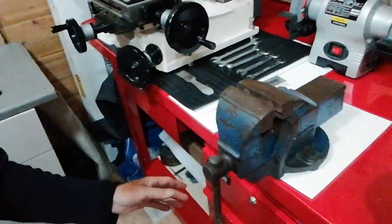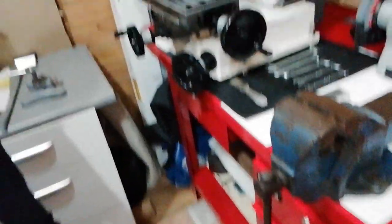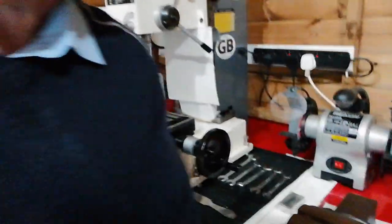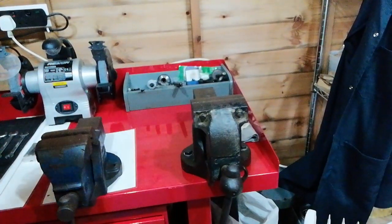Then we have to drill the holes. The best way to do this is to drill one hole first and then put a bolt in. But that might not even be the best position to put a vise anyway. We've already looked at the fact that it would impede access to the drawers. Even if you've not got a drawer there, it will still not be ideal, because the preferred position for one of these vises is at the end — like this other vise we've seen here.